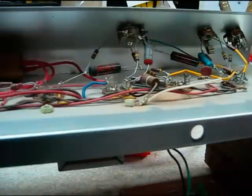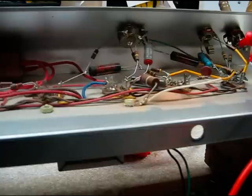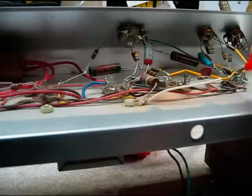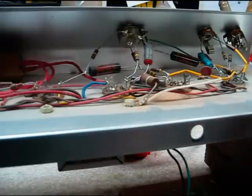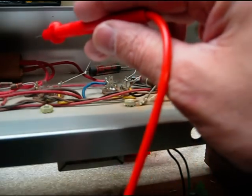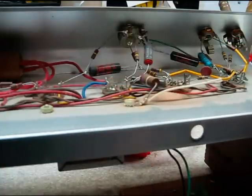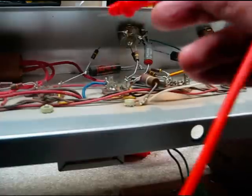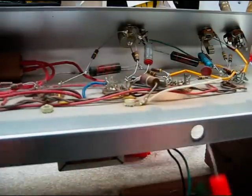What we're doing here is called a pop test. We've got our voltmeter and if we tap where the signal comes in from the jack — we've got a dummy jack installed — we're getting nothing, but when we tap where there's output from the tube we get a crackle. So my first conclusion is that the 6EU7 tube is no good and that's probably why this amp isn't working. We'll have to get a replacement. I thought I had one but I don't have one in my stash, and we'll probably have to order up that filter cap or figure out how to re-configure that setup to get a filter network identical to the original — which is important for getting the same sound — since that particular filter is most likely no longer available.